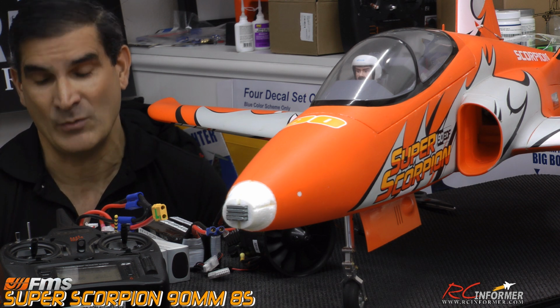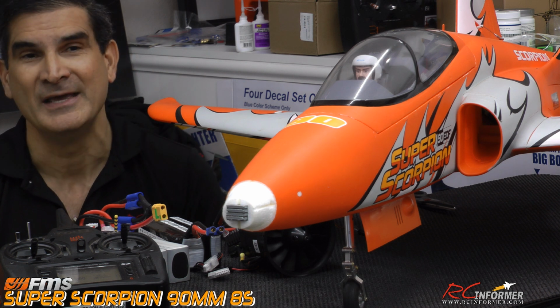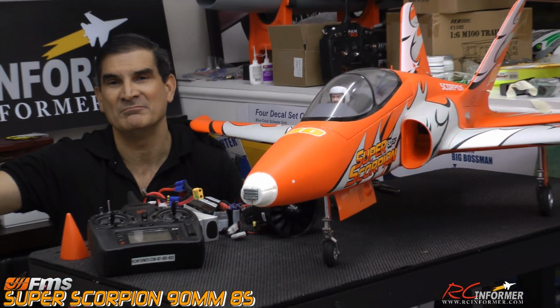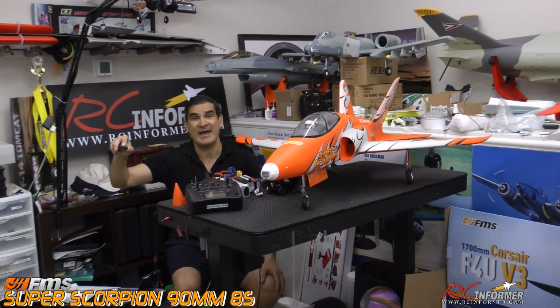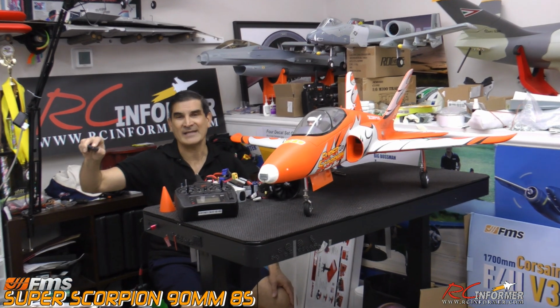So I put 2 ounces of steel weight up in the nose in the front, and that's how it's been flying actually since day one. So everything, even with the 8S, just sort of equalized out, which was kind of nice. So anyway, that's the deal there, folks.